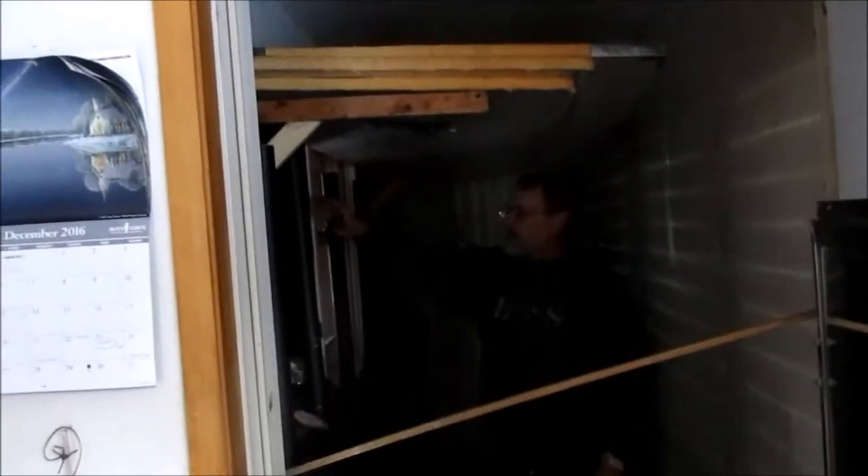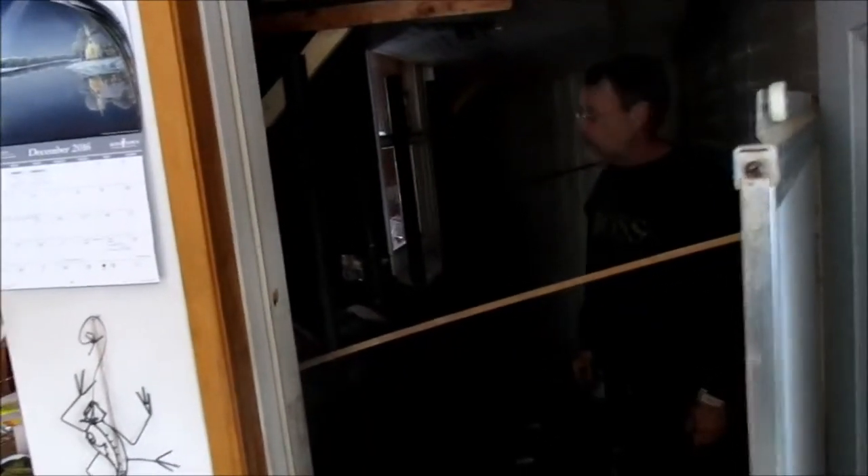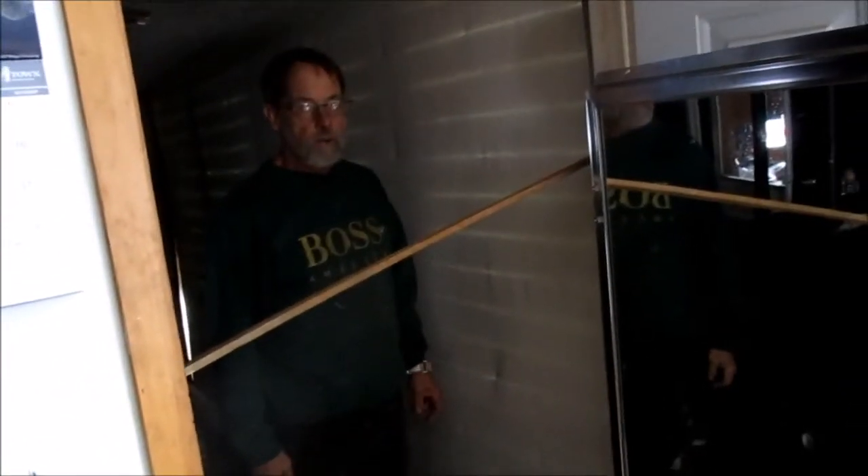Now it's closed up for the night. We have a cold air return down in the bottom corner where cold air from the kitchen floor naturally flows in and the warm air flows into the house. This back wall is not insulated, so a certain amount of heat during the day goes into the house. The majority of the heat is absorbed in here — all of this is essentially a fancy Trombe wall.